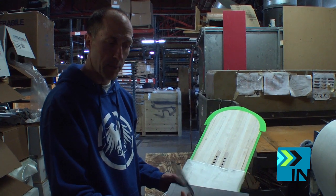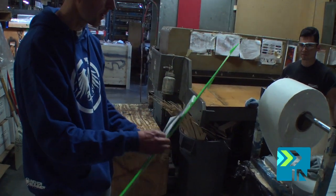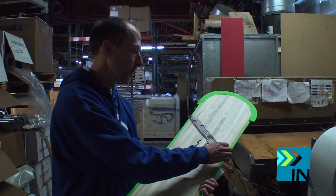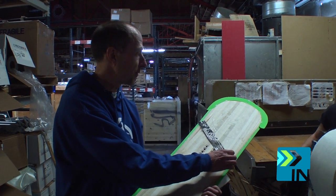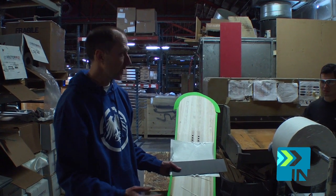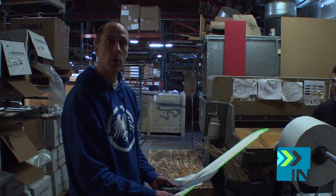You can see the carbon — there's not much to it, but once it gets cured it becomes really stiff and super strong. Some of our other models run carbon X's in the cambered areas, like out towards the mounting area, to really stiffen the board underfoot and in those cambered areas for a stiff, powerful feel. This is about the last of around 13 steps to make the core, so there are a lot of steps involved just to finish the core alone.